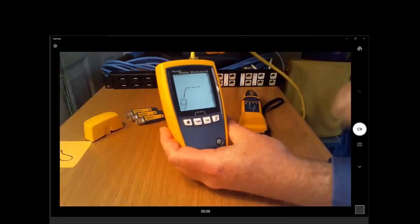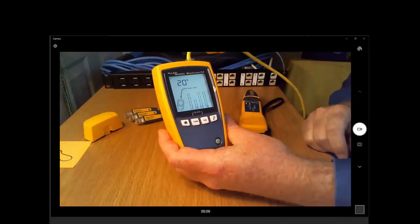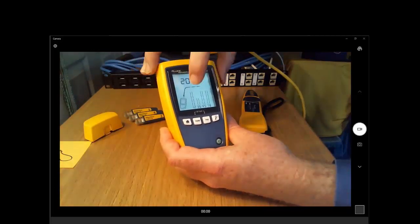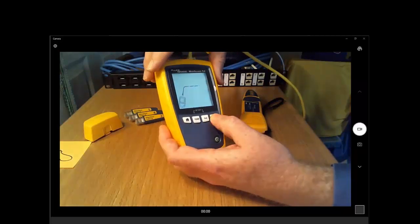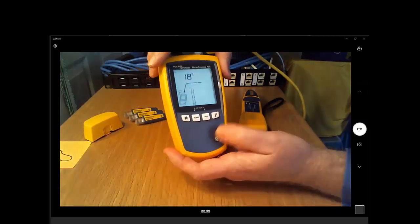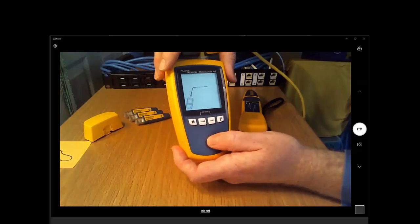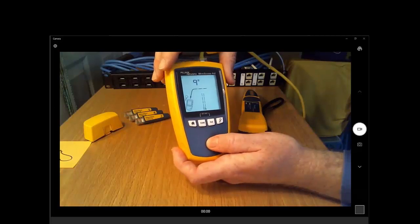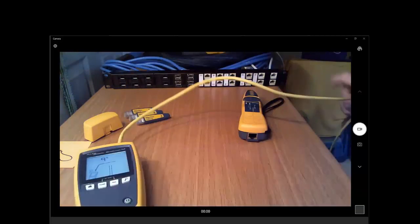So we've seen our problem. We don't have a network connection, and we want to find out the distance to where the problem is. So here we can see that the cable is open 20 feet away, but if you'll notice, this 3-6 pair doesn't quite have as many segments as the 4-5 and 7-8. This magnifying glass, so there's 18 feet, the 3-6 pair is open 9 feet away. That seems like we have a problem. Let's take a look 9 feet down our cable.